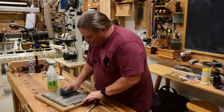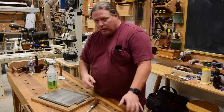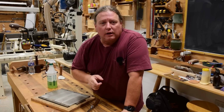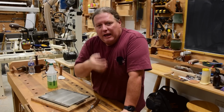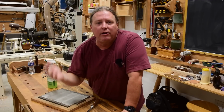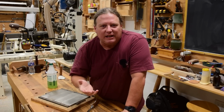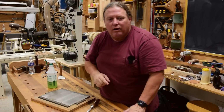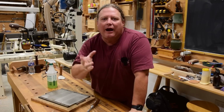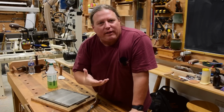And my 5th tip is kind of more a general tip that you can use anywhere in woodworking. Study everything and question everything, even the stuff you've seen in my own videos. That little tip about the cross hatch pattern, it only came to me because I watched a video from Christopher Schwartz probably 10 years ago of a very old gentleman who was sharpening a chisel in probably 10-15 seconds. And he did that kind of little circles here and there. And the cool thing about it was he was using the same oil stone that he had been using his entire life without ever having to flatten it.